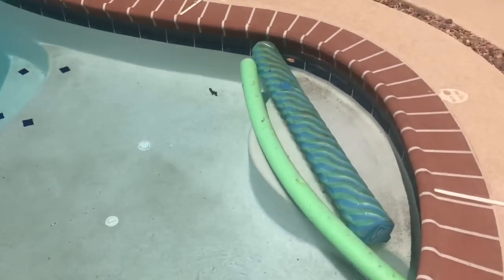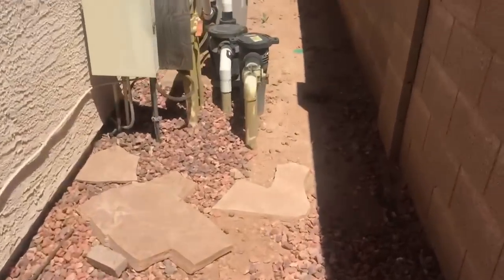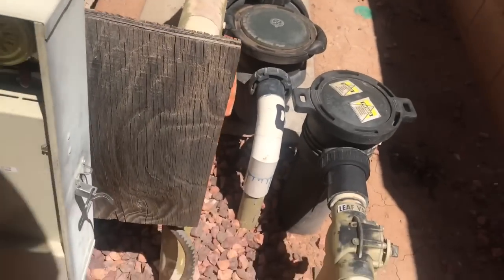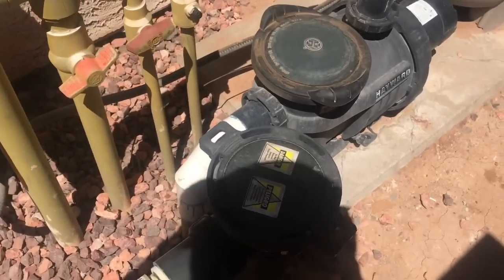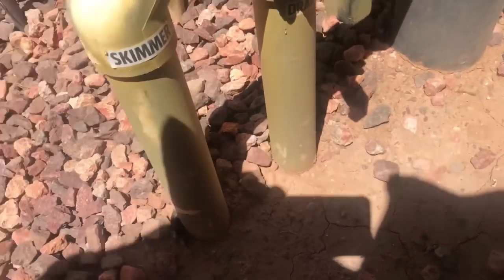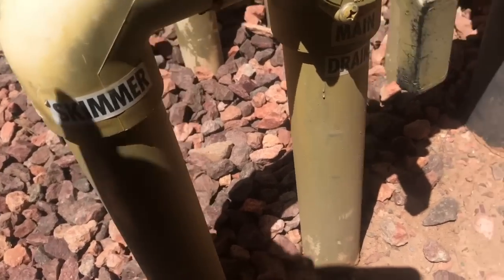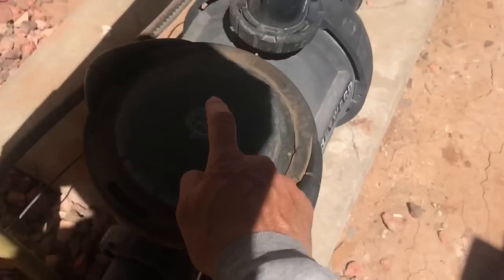These pop-ups don't seem to be working as well as they could. There's quite a bit of dirt on the steps and not a lot of water movement. In the first pool, the leaf canister was in the ground; this one happens to be here above ground — it even says 'leaf vac.' I tell people to leave that completely open so you've got full suction. This one has suction from the skimmer, the main drain, and it all comes through the leaf vac, so anything gets filtered through it before reaching the main pump basket.